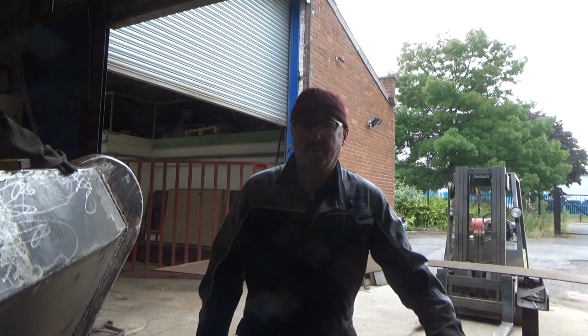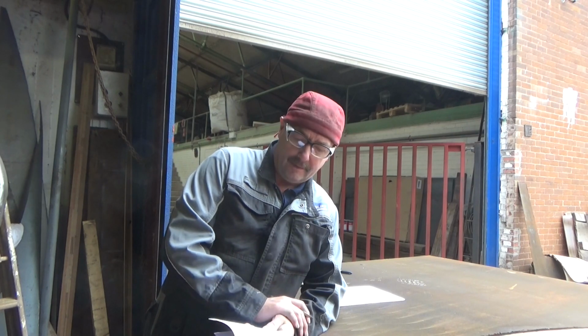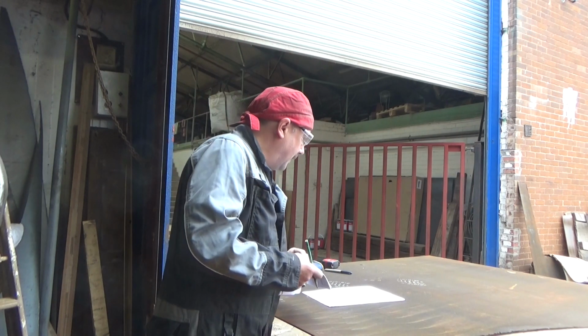Right, got some plate, so I'll go and measure the skin tank area that we can use. I've just measured the swim and I definitely need 2 tanks on this. The maximum I've got is 1.5 metre length and 0.4 metres high, so that gives me 0.6 square metres, and I need 1.2, so it's 2 side tanks on this one, because it is a big engine.